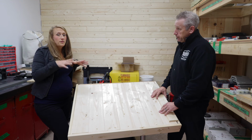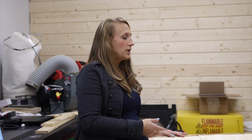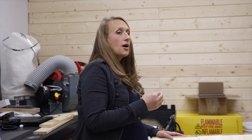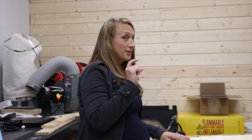Yeah, good point. Okay, so we've got our underlayment, and then you get your strapping on. That's kind of giving you the foundation that we would recommend for a metal roof, whether you're insulating or not. If they determine they didn't want to strap it, they just want to go metal right on, then obviously still your underlayment. But then we would recommend for sure making sure you have a roofing nail when you put that on that's not going to come through everywhere.